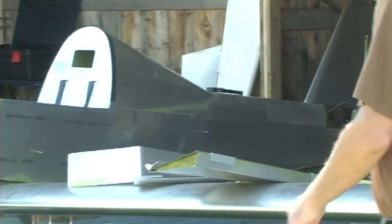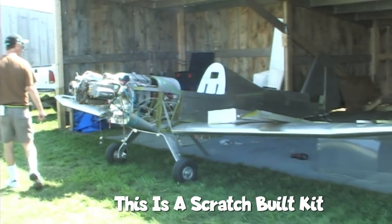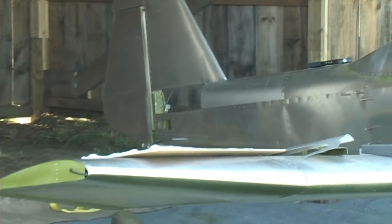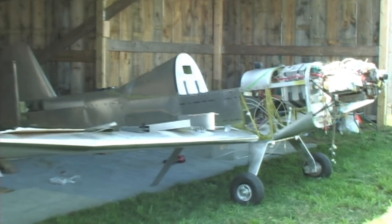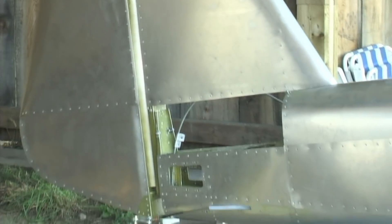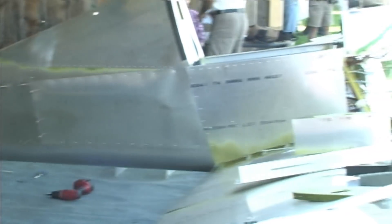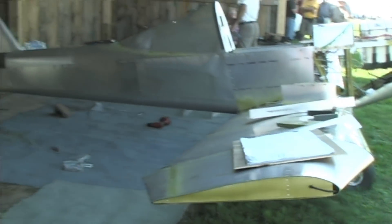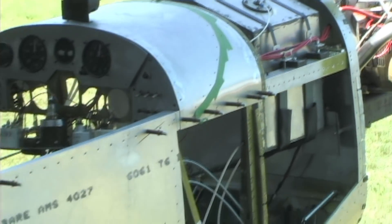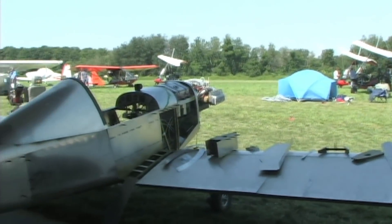A kit means I would have some parts that I didn't have to bend — would that be accurate? All the bent parts come bent. And for me, I'd worry about bending it wrong or installing it incorrectly. All the kits come pre-drilled with matched-hole tooling. So there's no layout involved. The builder fine-tunes the parts before final assembly — the parts cleco together right out of the box. He's fine-tuning ribs, doing some deburring, clamping the unit together, and getting ready to drill out to the final size for the rivet holes.